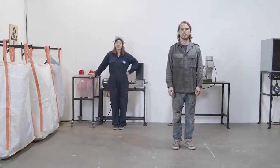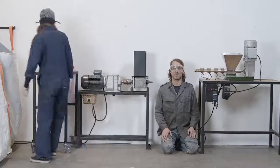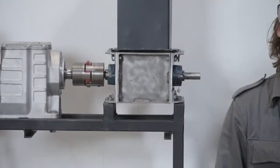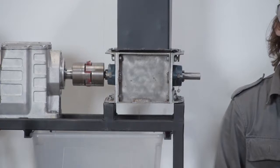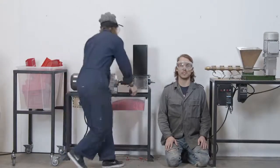Your plastic's sorted, now it's time to shred. When shredding, you'll need a container to catch the plastic as it falls. It's nice to shred directly into standardized containers that you can store right after shredding. This eliminates the step of pouring the plastic from one container to another and helps keep your plastic more pure. When your container is full, remove it from the shredder and store it on the shelf.